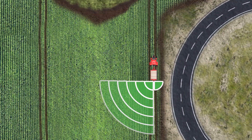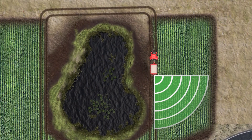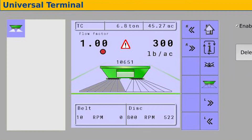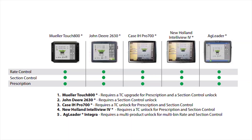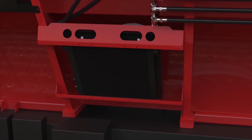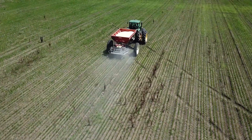When you come to point rows or are making a final pass that is less than 120 feet, you can continue to follow your set path and the BBI Sniper will automatically adjust your prescription and application history to target fertilizer only when you need it. The result is a more efficient spreader that is faster, more accurate, and easier to run than other spinner spreader models. BBI Sniper uses an ISO bus compatible dry rate control system available for use with most precision application terminals on the market today. You can expect longer machine uptime through BBI Sniper's oil cooler and closed hydraulic system, eliminating the need for high-capacity hydraulics and keeping oil within optimal operating temperature. The closed hydraulic system ensures a more predictable temperature range for accurate hydraulic control of spinners and bed chains.